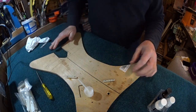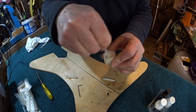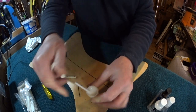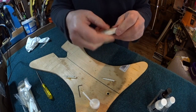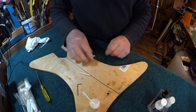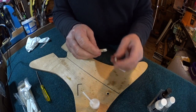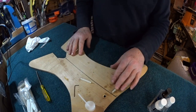It takes a while, and you have to have your sandpaper board ready, sanding board. This plastic is a bit less so, but the Milliput will clog up your sandpaper pretty quickly. So I tend to bandsaw it just to get rid of the bulk of it and then work it down to the correct dimensions at the end. As I say, this one's already been slightly reduced in the act of sanding it, so this one's a little bit taller. So they are going to be two different molds, which I'll keep together once they're done.